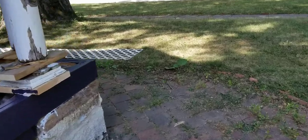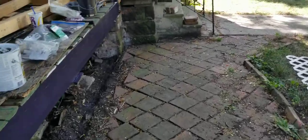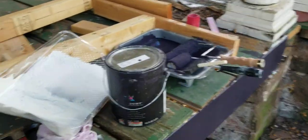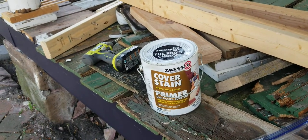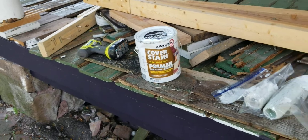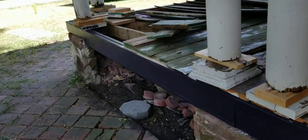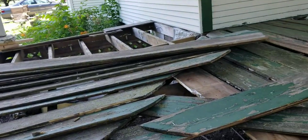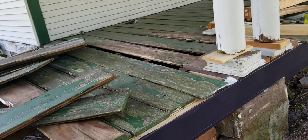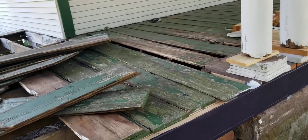This is a Menards color. I don't trust the one coat and you're done stuff, which is what I have here. I do two layers or two coats of primer, which is an oil-based primer. And then I do two to three coats on the black depending on how well it works. Looks like I'll probably just do two coats on this because this is all fresh, brand new wood. If it was older stuff, then I have one more step — a liquid mixture to put on the wood to rejuvenize it, refresh it, give it more moisture. Otherwise when you're rolling the paint on, it'll just suck the moisture right out of the paint and you'll never get a good coat.